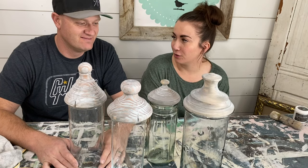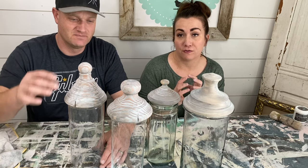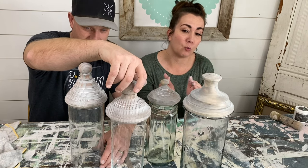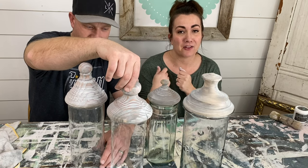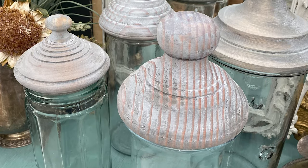This is just a fast Friday 'why buy when you can DIY.' I love the way that the Old and Gray and the white wax react together to give an old finish. Even if you're not working on this exact project but you've got some raw wood that you need to age — just use the Old and Gray, wipe it back, add the white wax, done. You've got an old aged patina in a matter of a few minutes.